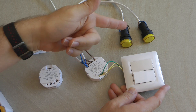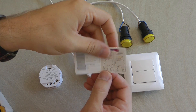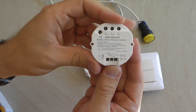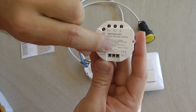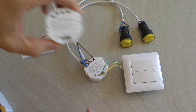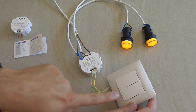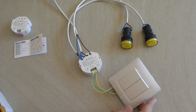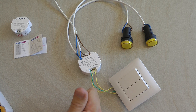If I switch one off, both lamps go off, which isn't right. Looking at the printing on the actual device, it makes more sense a different way: the left terminal appears to be the common, and then K1 and K2 are the two switched outputs — so left is common and the next two are the inputs. Let me switch the wiring around. After switching it: now if I turn one on, one lamp comes on, and the other switch controls the other lamp independently. So common is the left and the two inputs are the middle and right.